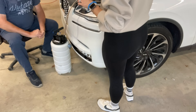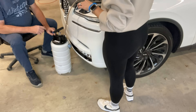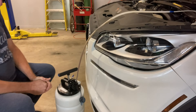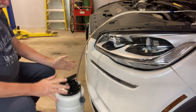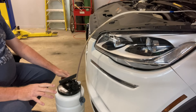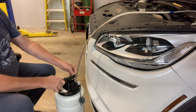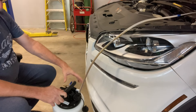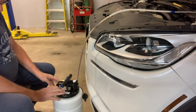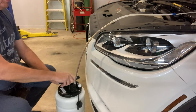Yes, you can do this manually. Last time I used air to create a vacuum to draw the oil in; this time we're using the hand pump. Make sure the blue valve here is shut so it's at a right angle — otherwise that'll be a leak. There's also a little valve on the side that relieves the vacuum. Now we'll just start pumping.